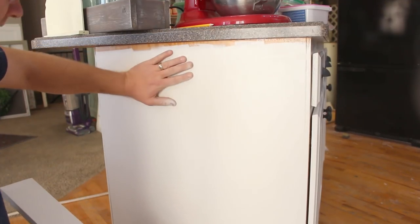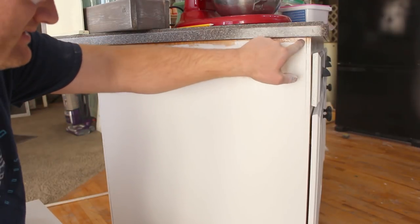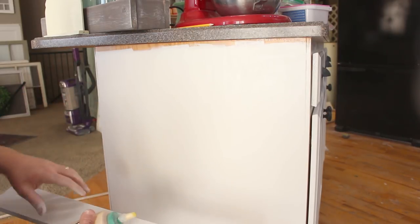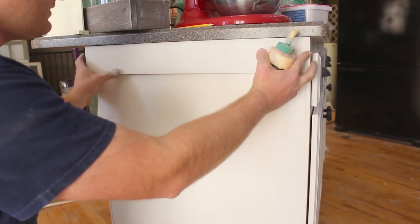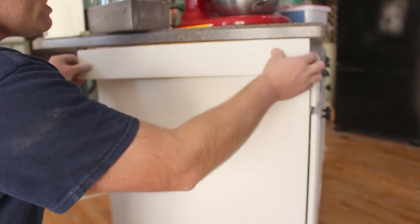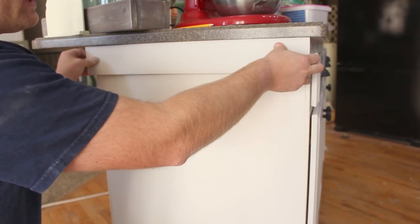This panel here doesn't have anything supporting it up along the top. It's just a quarter inch thick and then there's like a plastic brace on the inside over here. The back of it has a three-quarter inch piece about like this on the inside supporting it, but right here doesn't have much support. So I'm going to use a one-inch — I wouldn't normally put glue on this so I could get it off later, but since it's only going to be a short nail into a quarter inch of material, I'm going to glue it and then staple it on there with an 18-gauge one-inch nail.